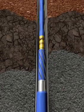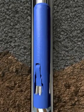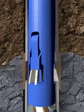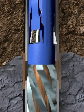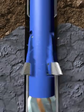Collar position is then determined by idling the pumps and slowly slacking off until the knives bump the collar. With the section mill positioned just above a casing collar, rotation and circulation are started. The cutout process is now underway.